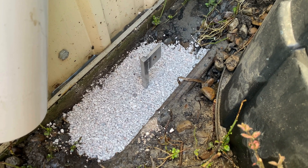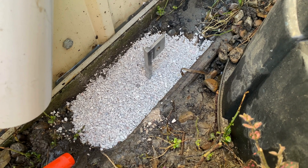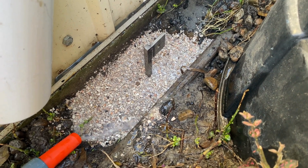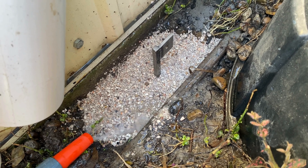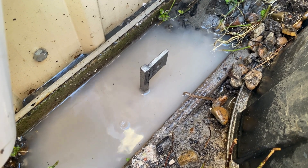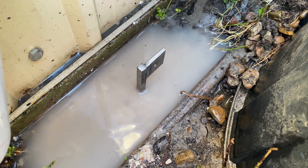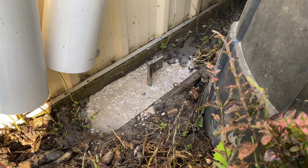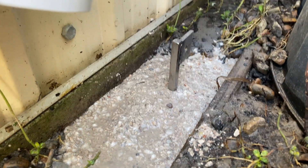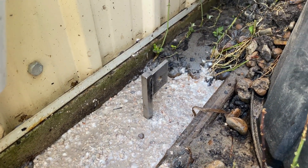You can add some water and fill that hole — it'll turn into a slurry, sort of like a clay paste, and that has a very low resistance. Gently fill that now, leave it running for a couple of minutes until the hole's full, and let it settle. It's full of water now — you can see the air bubbles coming out as that clay is expanding. That'll tighten up and pack around the stake. The water's drained, the bentonite's turned into a clay substance and swelled up. You can see it's mounded up around the rod. We can go ahead and drill some holes, run the cable to the stake and bring that up into the SPD panel.